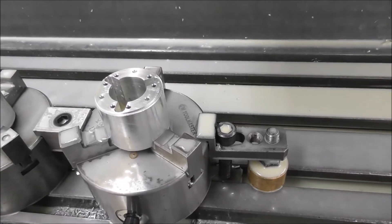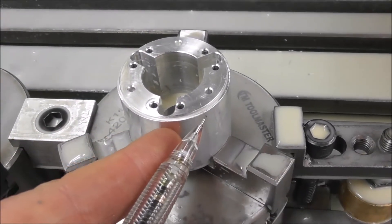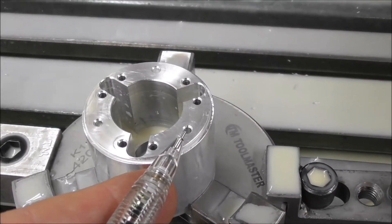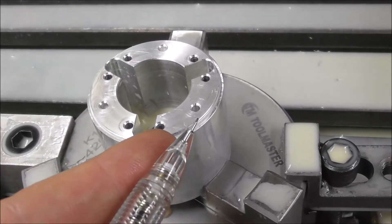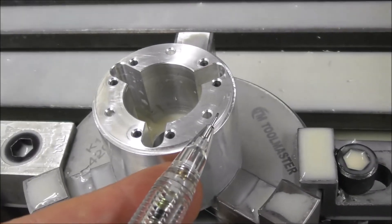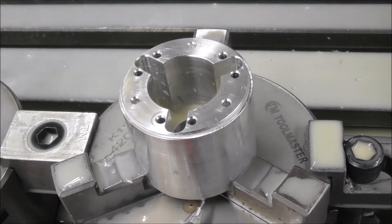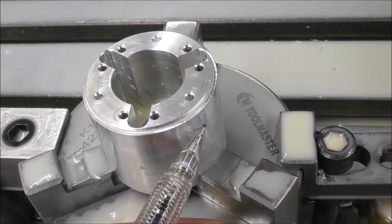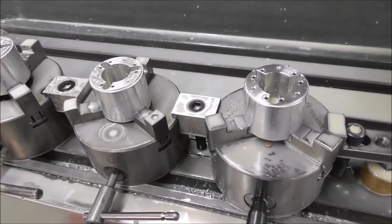Have a look on my YouTube channel ThreadExpress, click on the playlist, and you'll see videos specifically on machine maintenance. Going into the toolpaths in a bit more detail: the six millimeter end mill cuts the retraction slots and the location spigot on all three parts. Then it changes to a d-bit chamfering tool — it spots all of the holes to start the drilling position and also chamfers the profiles and the spigoted area. Then the drill goes in and drills right through on the six pogo holes where the jaws are not present, then drills blind holes for the three millimeter threaded holes that hold the end caps on. It's quite a lot of machining in this operation and it runs automatically for quite a long time, so I can go away and do something else.